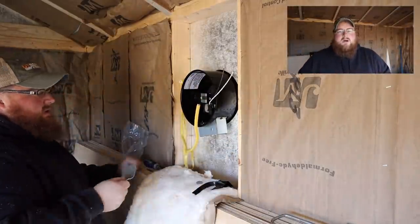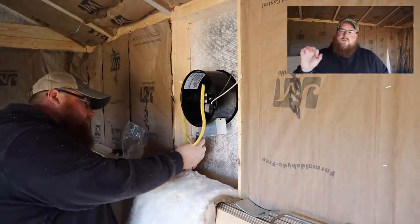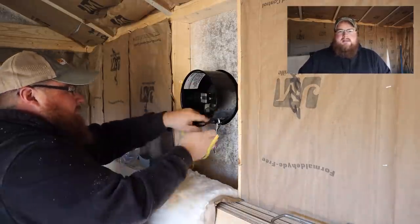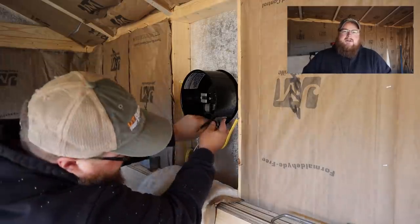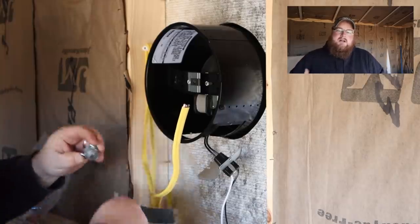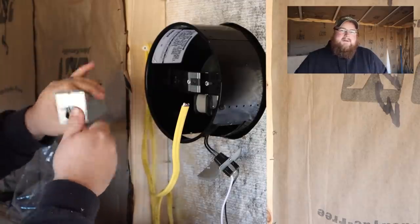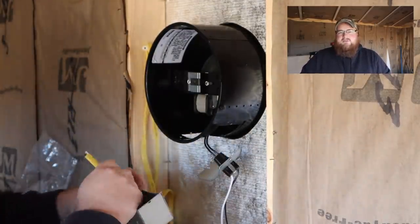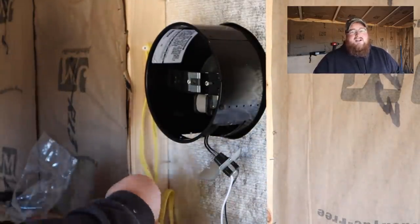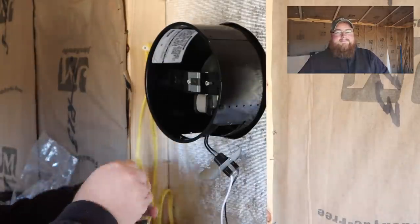Once you have that in place, then you want to go ahead and start wiring this thing up. For that you're going to need wire nuts and a wire thimble or clamp — I don't remember what they're called, but it's basically the thing that goes in the little circle knockout hole for the metal box and allows the wire to be clamped and held in place, and also not rub on the side causing a short or possibly burning the place down. I was kind of bummed out this fan kit didn't come with the wire nuts and the thimble for the electrical junction box, so there are a couple of extra things to add to your shopping list.